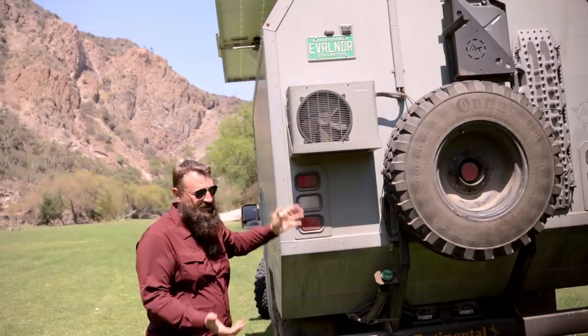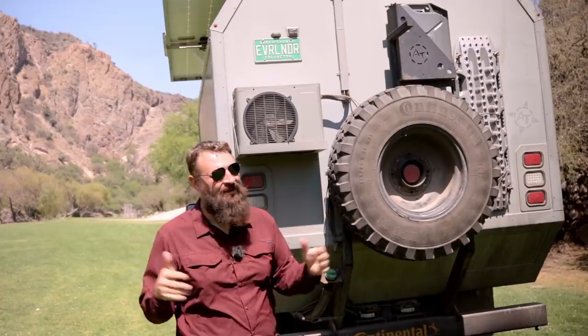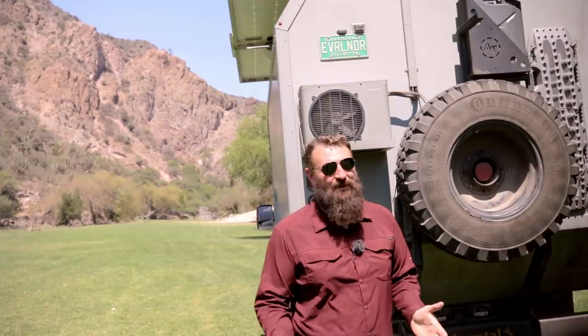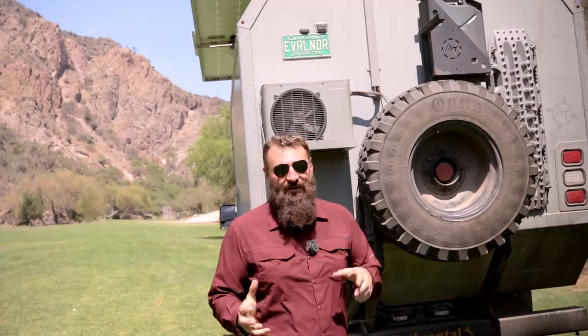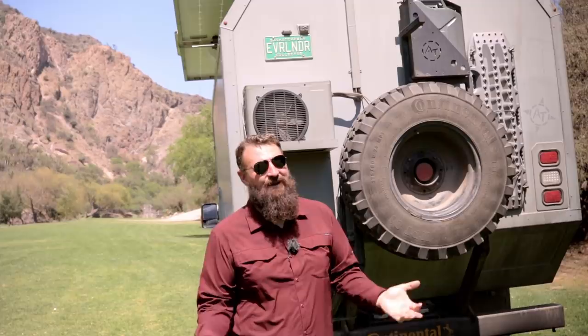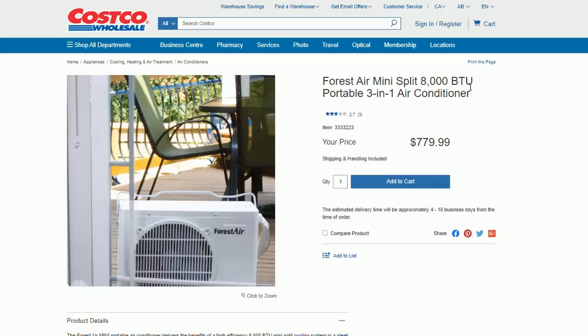A second disadvantage is you need to cut a big hole in your box to install it, and if it fails and you have to buy another one with a slightly different aspect ratio, you need to make a bigger different hole. Another disadvantage of a window shaker style is they're a bit louder on the inside — the compressor, outside fan, and inside fan are all mechanically connected and halfway inside your living area. They're also not well sealed, so that led me down the rabbit hole of finding a mini split.